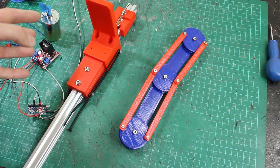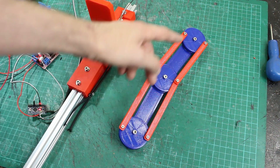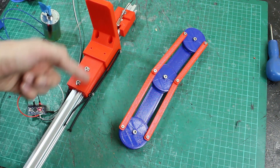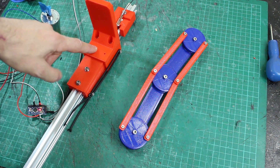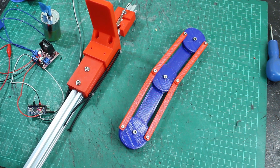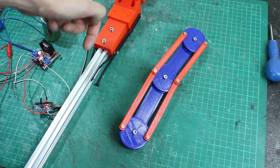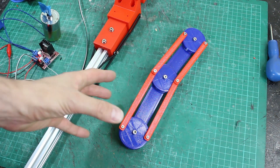So what we'd actually have, instead of just driving motor speed, is driving motor position. We'd have a feedback pot on each of these joints and drive it with a demand position. The demand position comes from a loop going round and round, measuring the position of this each time and adding that value onto the demand. If we keep pushing, that keeps adding a value to the demand position and moves the joint to that position. To go back the other way, we have another sensor on the back of the ankle that subtracts that number and moves the joint the other way. That means we can use a PID controller to code up the responsiveness of that motor.